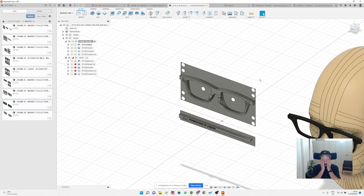Is there anything you'd like me to add for the next classes? Question: do you ever cut reliefs into the bridge or eye wires to make it easier to press in the base curve or to bump the bridge? Answer: I just keep them flat, and it holds its shape fine. It depends on which press you're using — sometimes it's a bit tricky with old-school presses if your nose pads are already in. But if you have the right press with a cutout for the nose pads, it's not really a big problem.